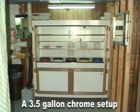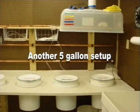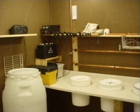And finally, don't take on any ambitious projects in the early days. Try and keep to straightforward, smaller items. And stay away from pot metal and aluminum until you can confidently plate steel, copper, and brass items.